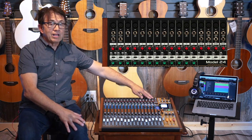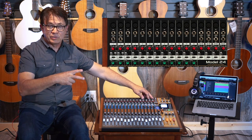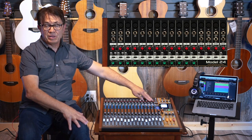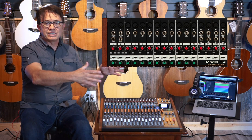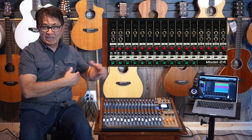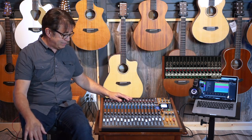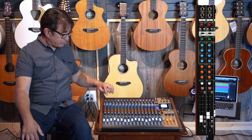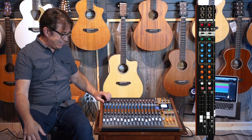The last four channels that have mic inputs are also stereo line inputs, so you can either use the four mono mic inputs or the stereo line inputs. That gives you some expandability — if you had a separate submixer for keyboards or maybe drums, you can just feed it into the stereo inputs and expand your ability to add more channels. As I go down the channel you have your gain control and a low cut filter, or high pass filter however you like to call it.